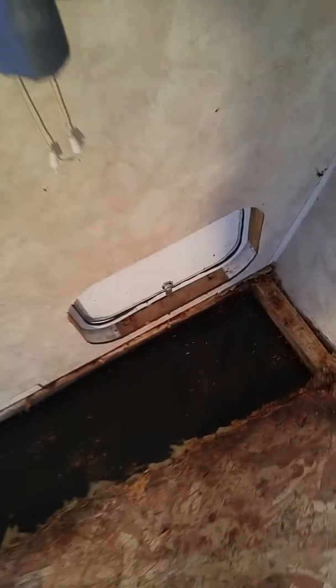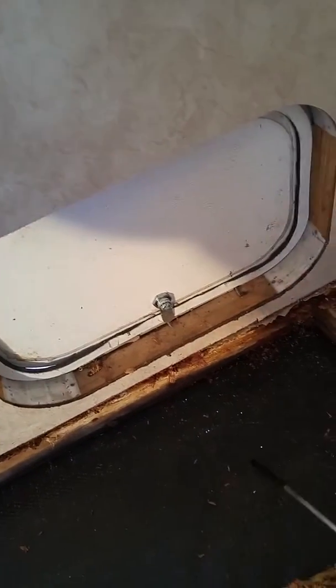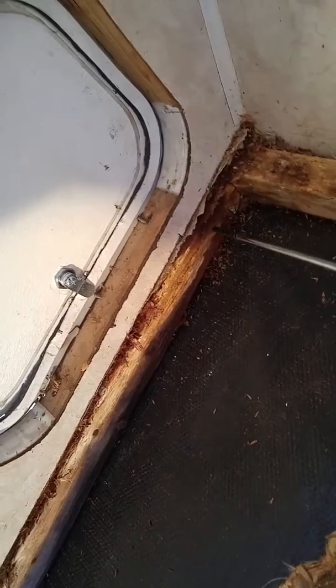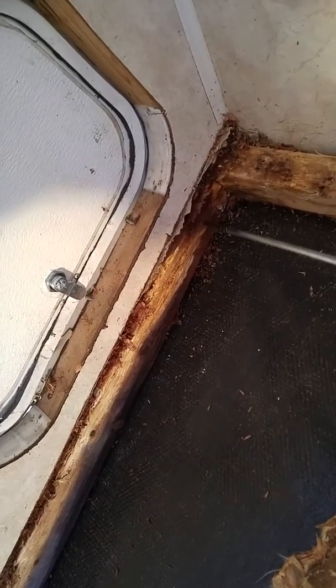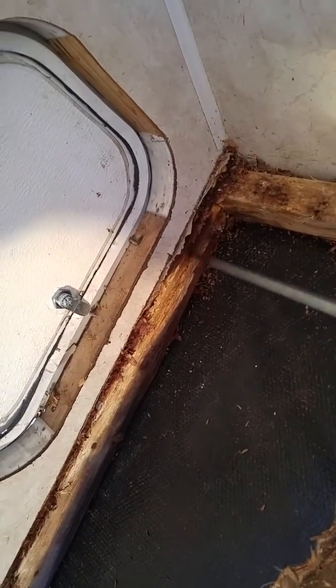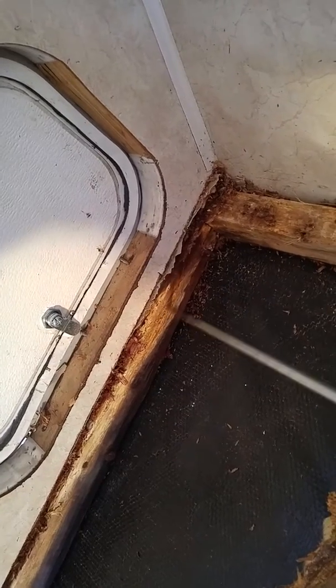You can probably see from the video the little holes in the waterproof membrane. I'm thinking water penetrated up through the bottom, though I'm not sure. The corner looks really saturated but it's still hard, luckily, so I won't have to replace that board. I'm going to buy some wood hardener — I believe it's called that — for wet wood. You spray it on and it helps to solidify the wood.